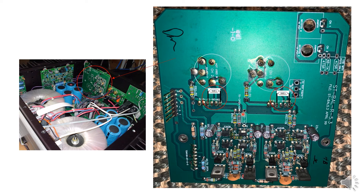It doesn't even need to be exactly 1Mohm — it could be 500K or whatever. Just don't go too low, because otherwise it might affect your input impedance. As you can see, this is relatively straightforward and you can solder this resistor without even removing the board — just open up the top cover. Hopefully you like the video and the tip. If you're more adventurous, follow up with my other videos to upgrade this amplifier to much, much better performance.